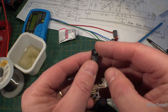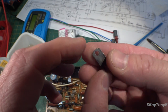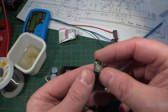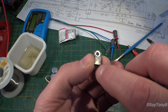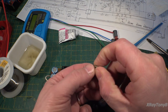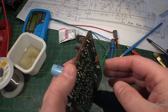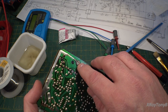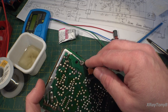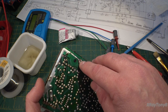Here is what the transistor looks like when you first take it out — notice how black and charred it is, that's all tarnish, even on the back. They clip off the center pin, which is your collector, and it goes through this little screw with a brass washer and goes to the back of the board through a nut. Normally this nut is just sitting on top and not always making good contact, so I soldered these nuts down to the board to make very positive contact.